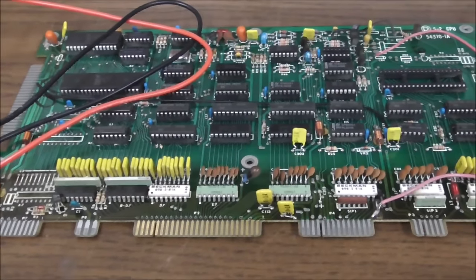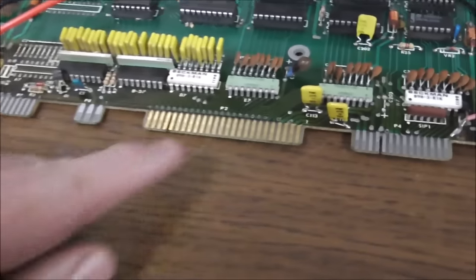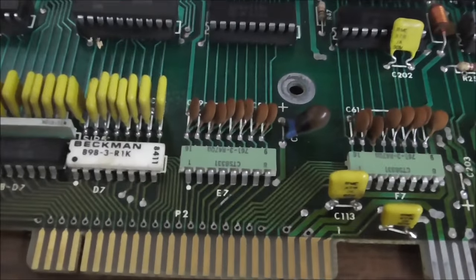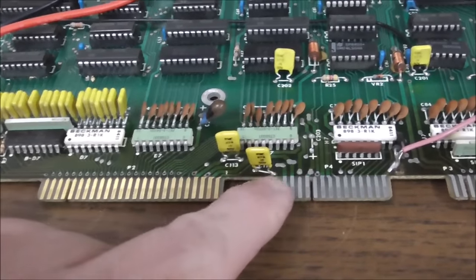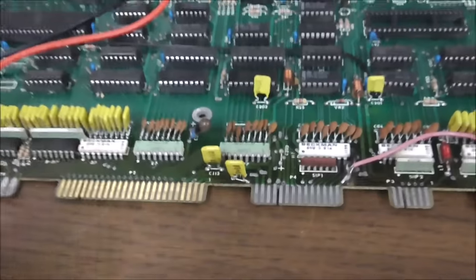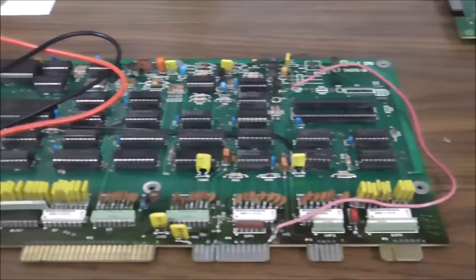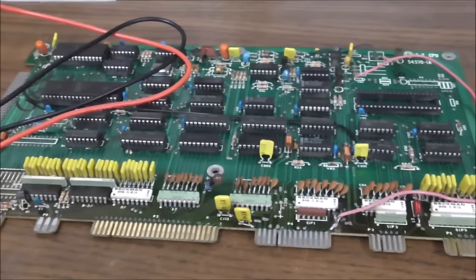We pulled it out. Look at that — it even fixed my meter, that was off point two. At least that capacitor is shorted. I'll test the traces now too to see if this and the one it's connected to is still shorted. If it's not, that was the only thing shorted. But as a preventative thing, I'm going to go around the board and find every tantalum cap and replace them because we're already getting them failing on this board. The value is a little weird to understand — it's blue, black, and brown, and I'm going to look on the schematics to see what the value is.